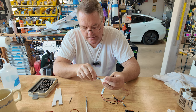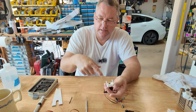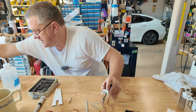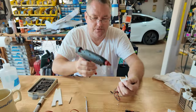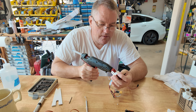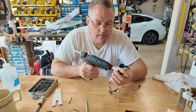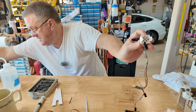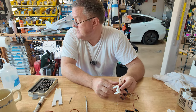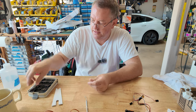Once you get the screws in, just like lug nuts on a car, I do an offset star-pattern tightening sequence, then do it again. I take it until there's a little resistance, call it good. Then tip of the glue gun right on top of those nuts - fill that little hole with just a dab. It's very effective and it's easier to clean out than Loctite. I guess I'm like a Greek father - they'll use Windex for anything, I'll use hot glue for anything.